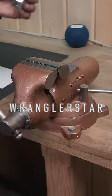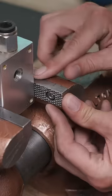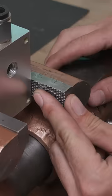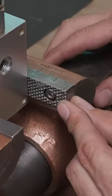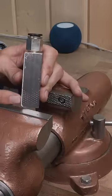If you regularly use a bench vise and work with soft materials, you'll run into a serious problem immediately — these hard tool steel jaws. Quality vise jaws will have deep, heavy knurling made with a milling machine for grabbing. This is a very useful feature, until you're using something soft, and then it mars your work terribly.